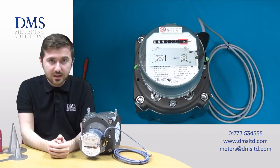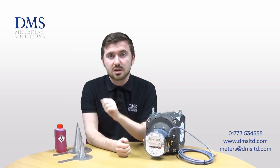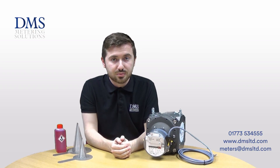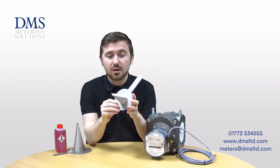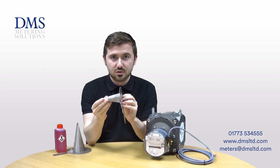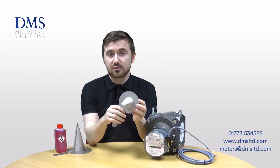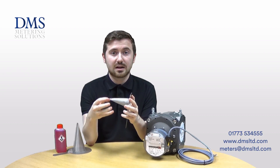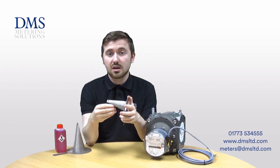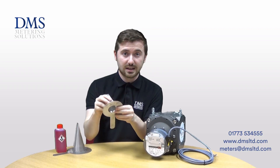As standard with these meters, we can also suggest the use of filters to protect them from any harmful debris. The filters we supply as standard are of a top hat commissioning style. These go into a system, sit between two flanges, and are then removed after about four to six weeks of operation, as they will have collected quite a good amount of dirt or debris during that time, after which the system will be pretty much clean.